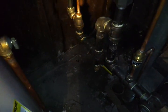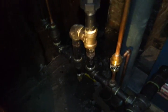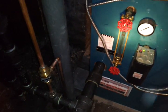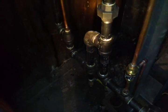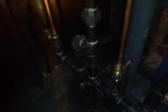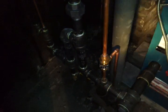Here we come down to our Hartford Loop. This T right here is a critical measurement — this T should be two inches below the water line. There's a marked water line here. This allows the condensate to replenish the boiler water. So it's a constant cycle of evaporation and condensation.